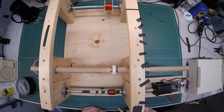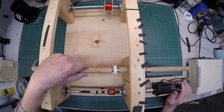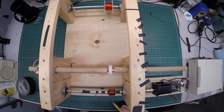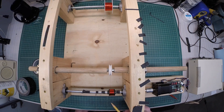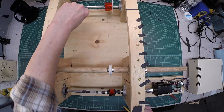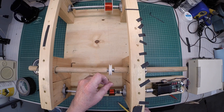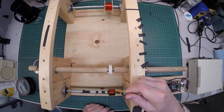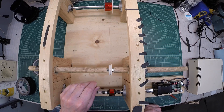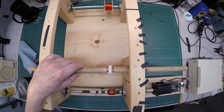We'll check DC resistance when we're done. Let's head back in the opposite direction now. I've got wrap 2 done, and I'll show another close-up — I did have a few gaps there in between. One big modification I made to the coil winder, still far from perfect, is I need to feed the wire in as close as possible. A nice modification would be to put a guide closer to the receiving spool to make this more accurate, especially for thin gauge wire like this. After letting that set up, I'll come back with an update once I get down to the final turns.